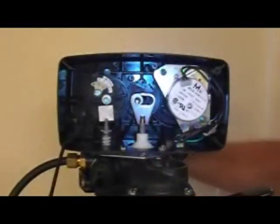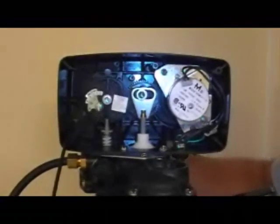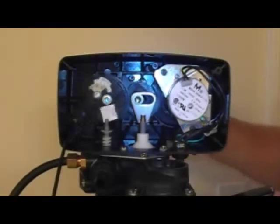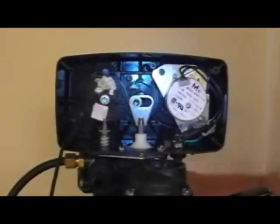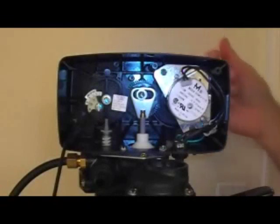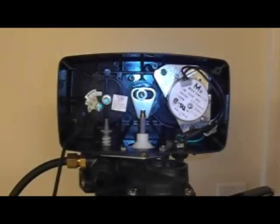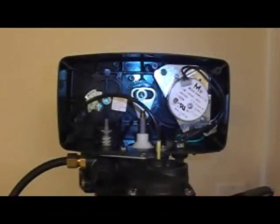Go ahead and grab this front knob and see if it feels good. That clicking noise is just the motor gear mechanism ratcheting as it should, letting you turn it freely. Sounds like new — of course it is new, I'm using a brand new valve, so yours won't look so pretty. Put the back plate on, put your cable back in, turn the water on, and you're done.